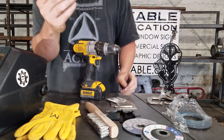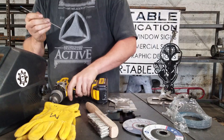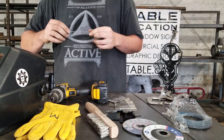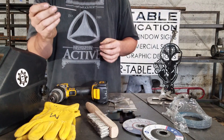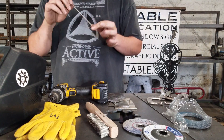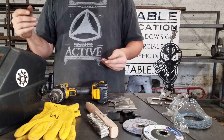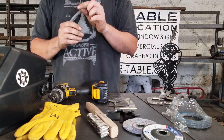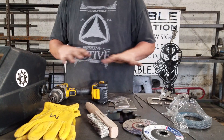You're going to need tungsten for your TIG welder. I use lanthanated tungsten — I think it's the only tungsten that doesn't have radioactive material in it. If you watch Jody Collier, Weldmonger, Welding Tips and Tricks, he says this basically has the same characteristics of all the other popular electrodes, and it's just a little bit safer because there's no radioactive material inside. So when you sharpen it, it's creating a fine powder dust. You can buy a dedicated sharpener, but they're like $300. Or you can just get a tungsten that's not radioactive and hopefully it's a little bit safer. That's pretty much all you're going to need for tools — it's a pretty simple setup.